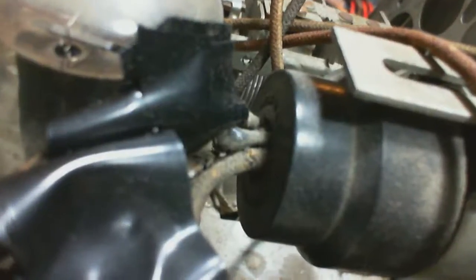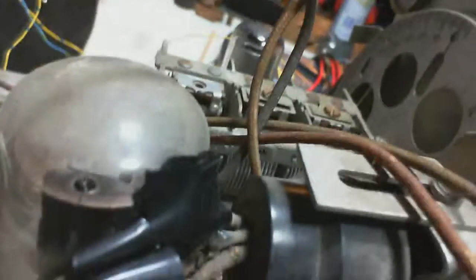So another option is cut each wire one by one, slide a piece of shrink tubing on the wire, maybe down here temporarily, resplice the wire, slide the shrink tubing up over the wire, shrink it down. You might get a reasonable result out of that, it'd be pretty ugly, but I think you'd just end up with the wire all disrupted just beyond the shrink tubing down here somewhere. It might even look okay if you did a really careful job of it. But there's a chance the wires are broken right up tight to the back of the socket here, and maybe just inside too. We can't be sure. I think you know where I'm going with this.